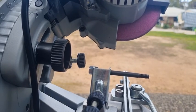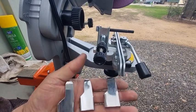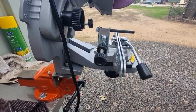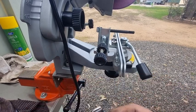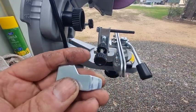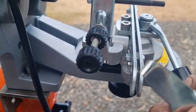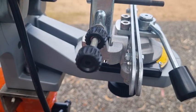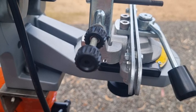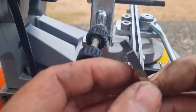I've actually been experimenting and made that many different ones to find out what works better. Typically a narrower one works better than the fat one — they're almost the same width, just a fraction of difference. Interestingly, I've got a Stihl USG grinder which is about three to four times more expensive than this Tecomec, and the backstop on the Stihl USG is dead square — it's only five millimeters wide.